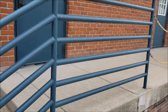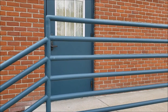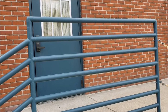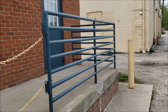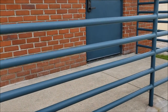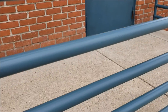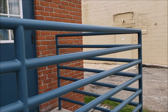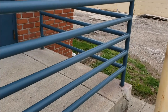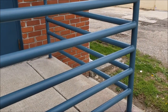As you can see, I've got it just about wrapped up. I've got one more small handrail over by the office. This is the same church — the front entrance handrails I did earlier were just chipped really bad, and I think they were poorly prepped when originally painted. This one was peeling and had rust all over it. I had to use etching primer with rust inhibitor, then two coats of really good paint, and then came back for touch-ups on the light spots. It turned out pretty good.